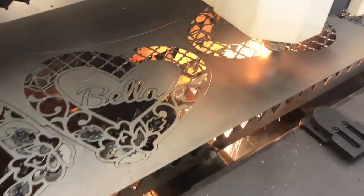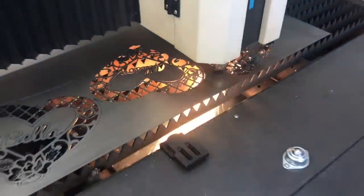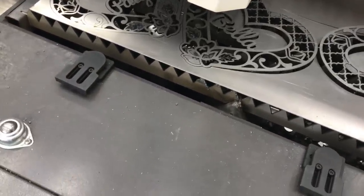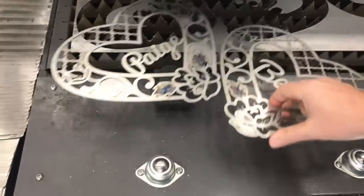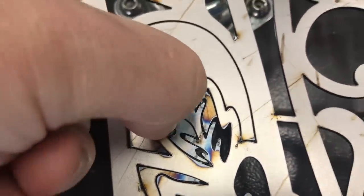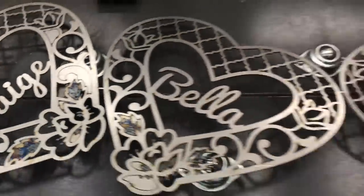It's doing the overall outside contour now, so we'll get a look at it when it's done. I've got this all bridged together as one so it'll go through the belt sander as one piece. I left some small bridges on it, but you can see only these little details here have some heat affected zone - everything else looks pretty clean. I'll knock those out, throw it through the belt sander, and look at both sides.